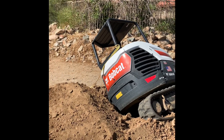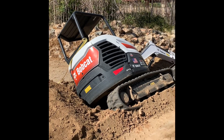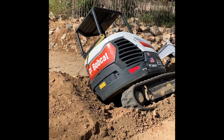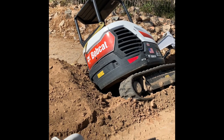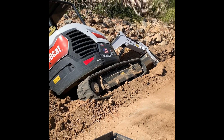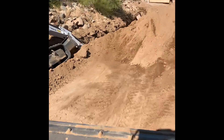I've tried a couple things already, but I decided what I'm going to try — I backfilled the trench behind the excavator and the tracks still move. I really can't spin the turret because the whole body is up against the side of the trench. Since I can't quite get dirt under the track that's at the bottom of the trench, I'm going to try to break the dirt away from this track and see if I can get this to level out a little bit by taking dirt out from underneath.